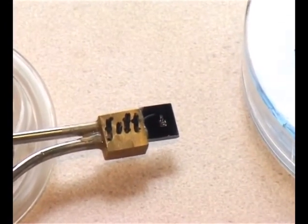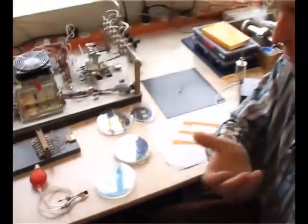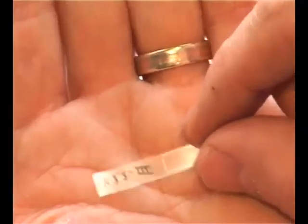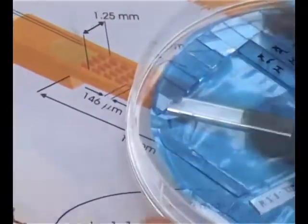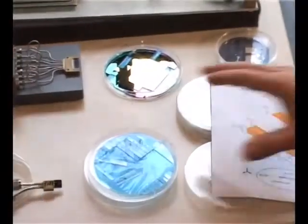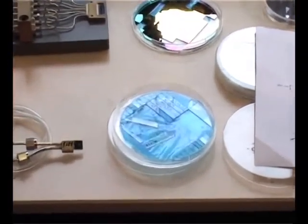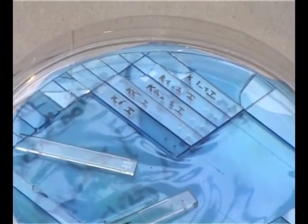This has been machined in silicon using micromachining technology in order to establish a check valve that has a minimum of dead volume, since dead volume is a loss term in the compressor — it reduces the efficiency of the compressor and the cooling power. The device is a few centimeters in size. These are test structures to characterize small restrictions, and at the moment we are manufacturing this cooler for test purposes in a Joule-Thompson type of system.